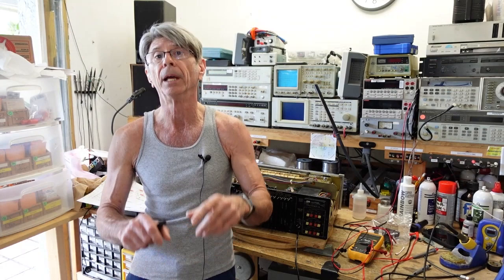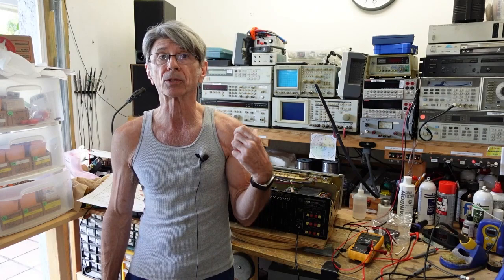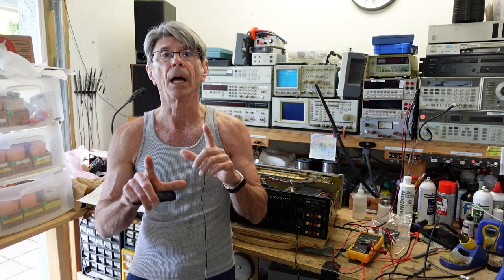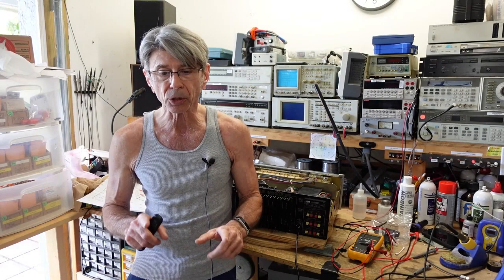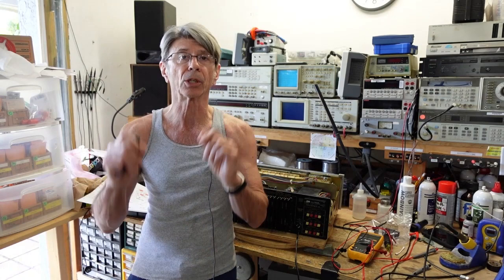In any event, now that we got it working, I went through and I finished the restoration of the F2624 board, tested the unit, and then I did the restoration of the power regulator board, which is the F2656. Tested it again. The MO you always take is to restore one area or one board at a time and test the unit. This way, if you introduce any troubles, you will know that they're isolated to that last section. So I'm going to show you some schematics of the boards that I have so far done, and show you the before picture of the board and the after picture, and the schematic again outlined with the parts that were replaced.